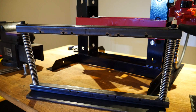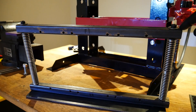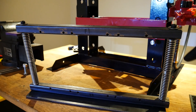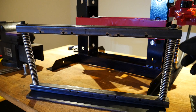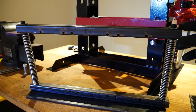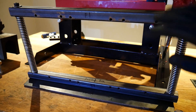If you're lucky enough to have adjustable hand reamers, you can drill five-eighths-inch holes and ream them out to a perfect sliding fit. Alternatively, you can drill the holes out even larger and use a bushing — that's actually what I did. I have flanged plastic bushings installed in the bar. You don't have to use plastic; bronze bushings work great too, or you can go with no bushings at all — steel on steel with enough clearance will probably still slide well enough.